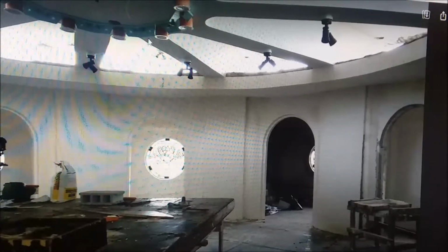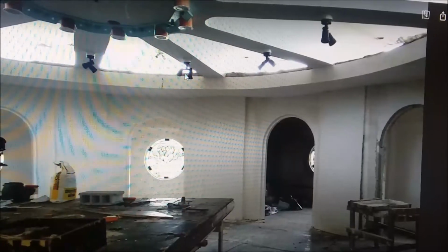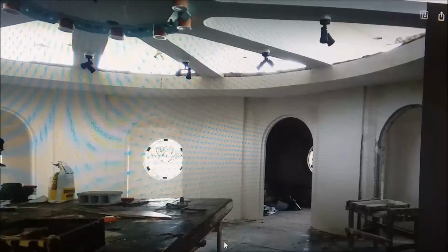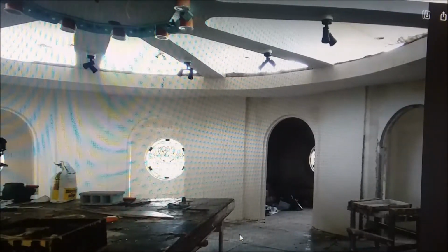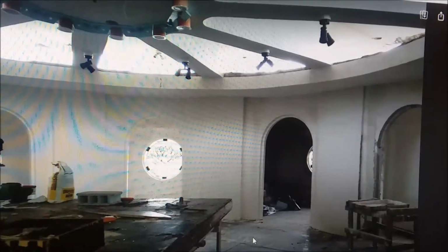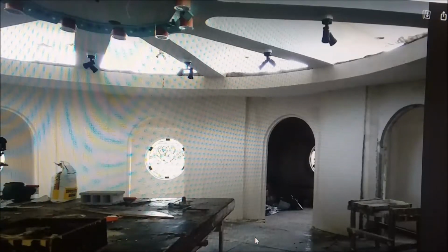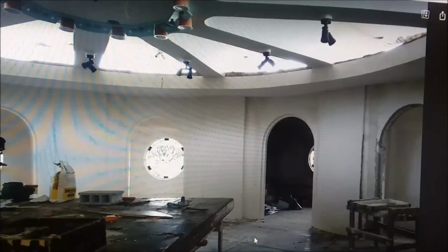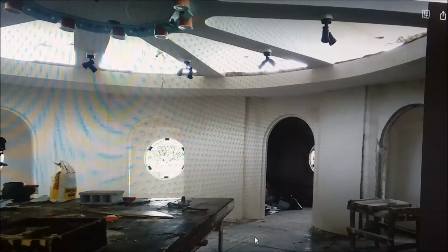The 10 can lights are on one switch. This ring is on a switch. The next ring is on a switch. The ring down underneath of this floor, under the catwalk, is on a switch. The ones around the outside of the house are the same height as those ones under the floor. Those are on a switch. They're on 4-way switches, actually. So the master bedroom has a full set of switches. The house girl's room has a full set of switches.